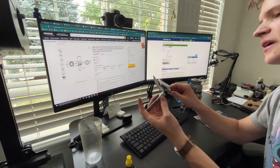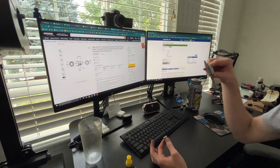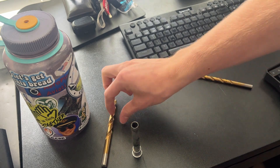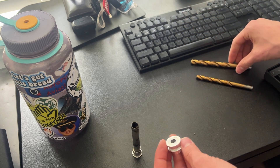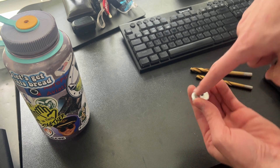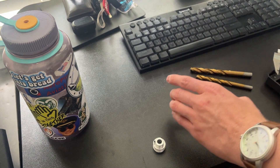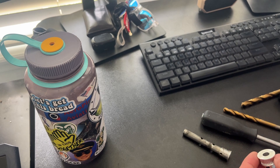There's just no right answer — it's about which compromises you want to make. Do you want to compromise on how many turns it takes to go around, or on how sturdy it is? Right here we have an 8 millimeter drill bit showing it's an 8 millimeter shaft size, but going up to 10 millimeters is a huge jump and will be a hard operation to do precisely. I have a drill press so we can make it nice and parallel, but the best solution might just be to knock this out. This dimension is 14.3 millimeters and this one right here is 14.2 — this might just work perfectly so I can fit this part on here.